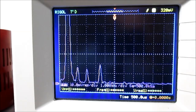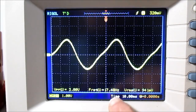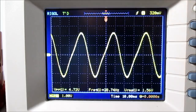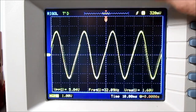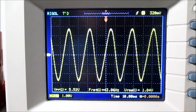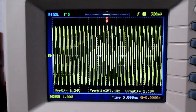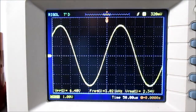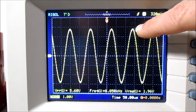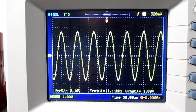This is the 10 to 100 Hz sweep. At 20 Hz it's not quite all the way up and it's a little bit distorted, but it cleans up around 40 Hz or so. And on the 20 Hz to 20 kHz sweep, you can see we peak a little bit and then we're starting to fall off around 10 kHz — not much really, but it is falling off.